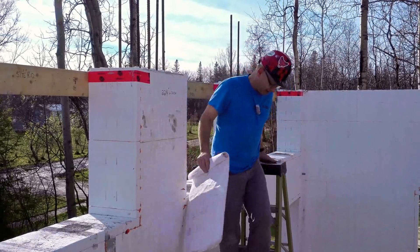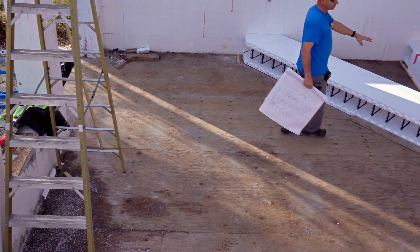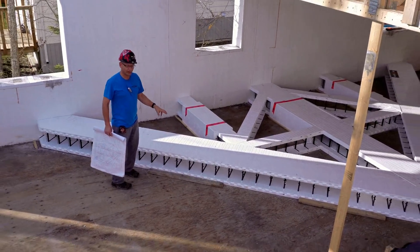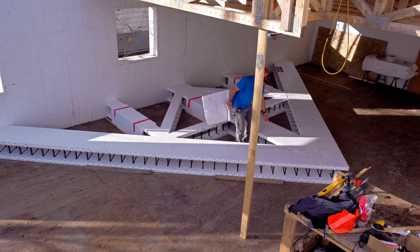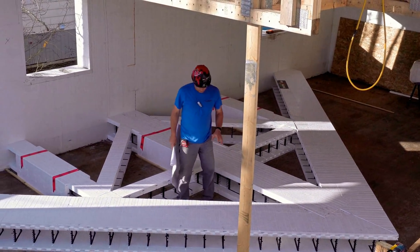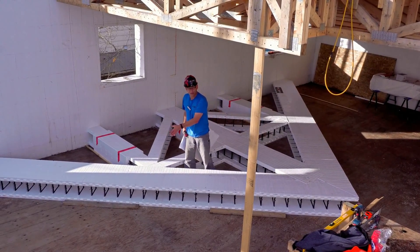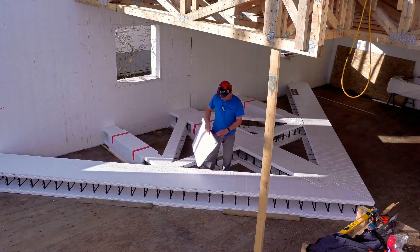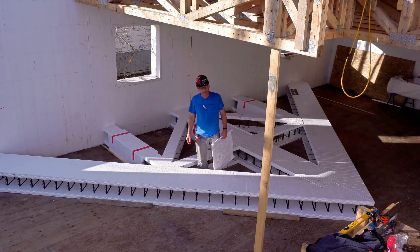So this is what we did on this one. I came here to watch these guys build, and these guys are pretty sharp. Look on the ground here - we just found a nice clean spot on the floor, chalked out lines, put the block down, and fit them into where we need to fit them. Now we know that it's perfect, and it's a big puzzle piece. We've got this middle column, and it's actually squared off right here. So we'll put this one piece into place first. Then we'll take these beams that we've created - these ones were done with the block running in this direction. We didn't cut them at a fancy angle. We just took - actually this is 24 inches exactly - an 8-inch piece put onto a 16-inch piece, and we made that beam. And wherever these came together, we just made a straight cut. That's why we've got spray foam - we can just strap that together. Once the concrete's in there, it's going to look beautiful.